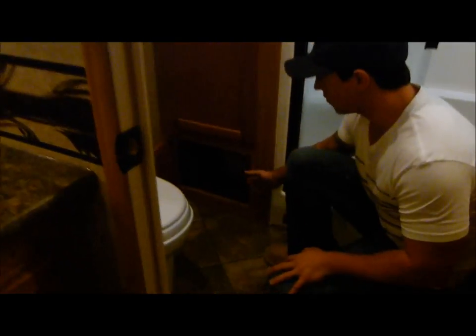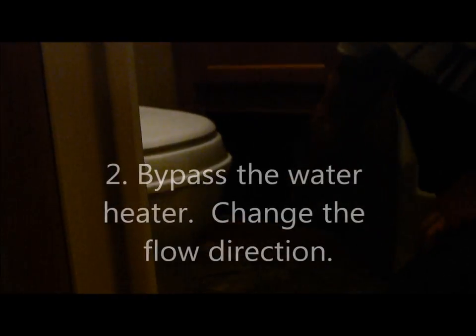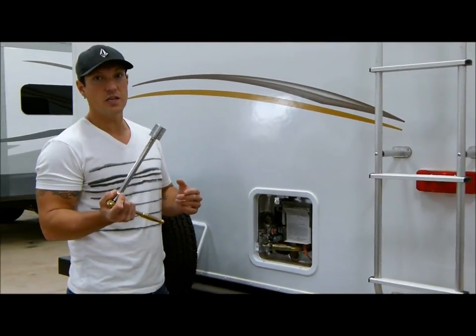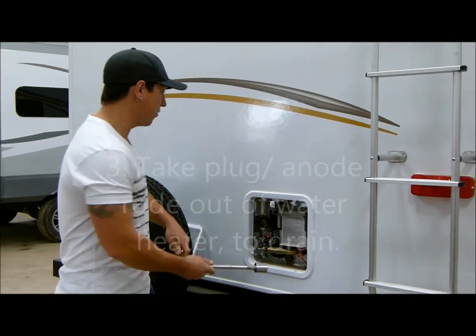It's quite simple — this one's got a drawer; some you might have to take a couple screws out to access the back of the hot water heater. This one's just got a single valve system; some have three valves on them. The valve is just behind here so I have turned it — the hot water heater is now bypassed. This hot water heater takes a one-and-a-sixteenth socket to get the anode rod out.